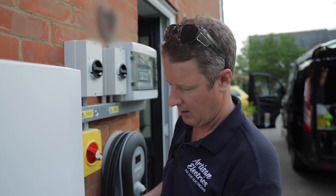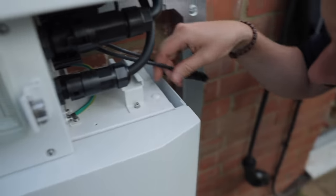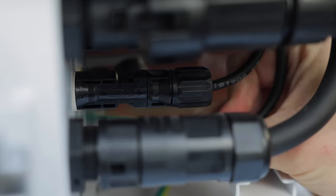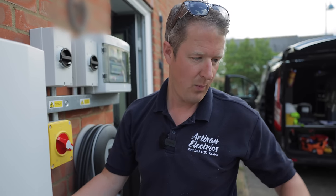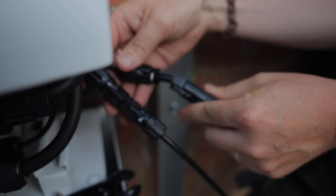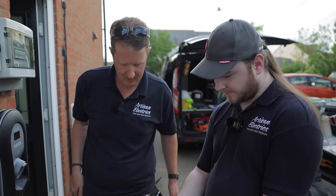We disconnected one set of string cables from the inverter and plugged them into the PV tester. The transmitter is up on the roof reading irradiance and temperature. We press auto — it reads the instantaneous open-circuit voltage, short-circuit current, and watts per metre squared based on the irradiance reading. It also does an insulation test reading. That gives us all the readings needed for the certificate. We turn the isolator off, unplug the MC4s, and plug back into the inverter. That was string two — now we test string one exactly the same way, saving the results in a special folder.